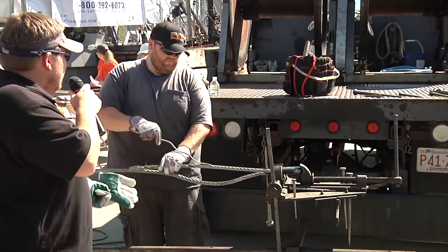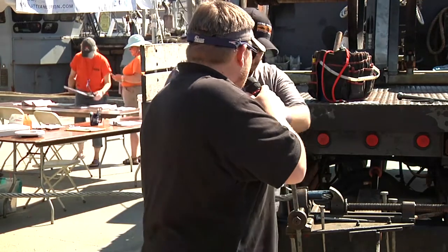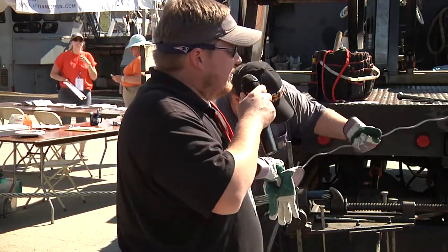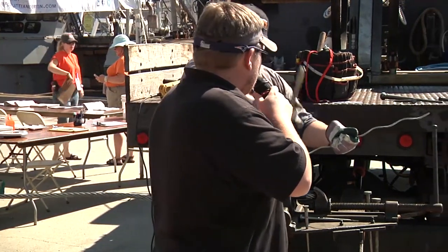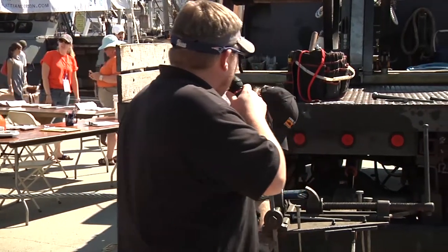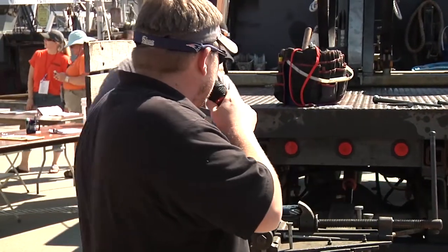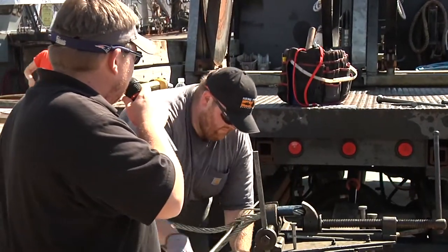So what he's doing is he's tensioned everything up, as you see here, and he starts by breaking the wire in half. So he separates the three strands, three on top, three underneath. And what he's going to do is pass first one strand through, entire halfway through the wire. He's going to bring it back.